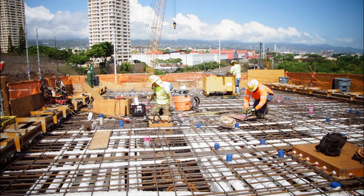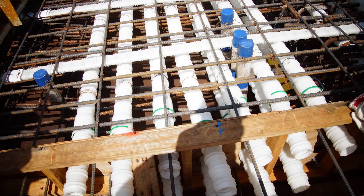In this example from the Hawaii Light Rail project, you can see the white plastic post-tensioning ducts within the reinforcing steel. You can see them closer here. Notice they're empty because they're post-tensioning ducts and the concrete hasn't been poured yet.